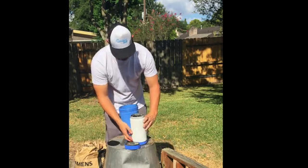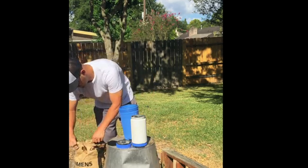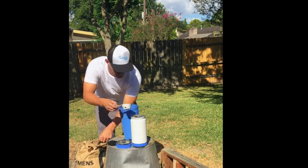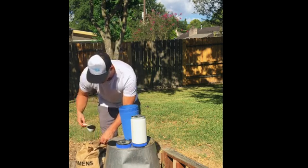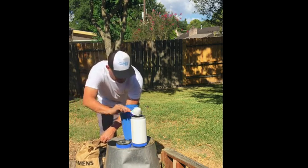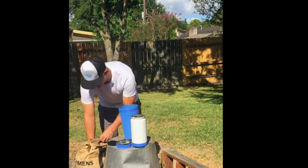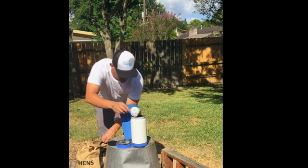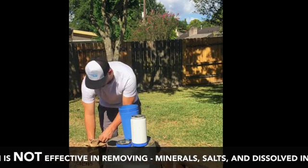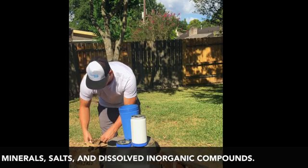As you watch me refill this carbon cartridge, I'll talk a little bit about what carbon filtering is used for. Carbon is used to remove contaminants and impurities using chemical absorption. They're most effective in removing chlorine, sediment, volatile organic compounds — also known as VOCs — and taste and odor from water.